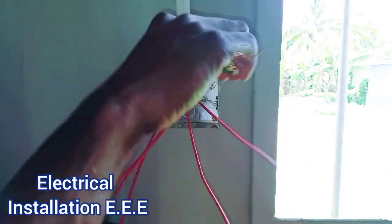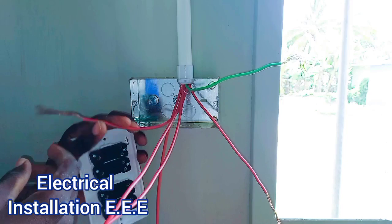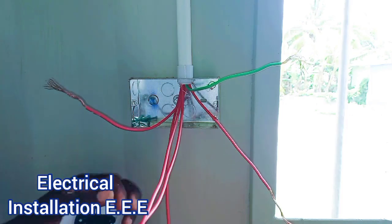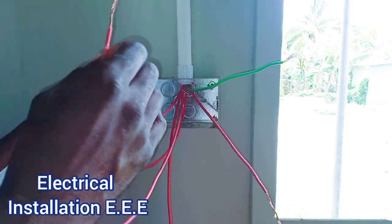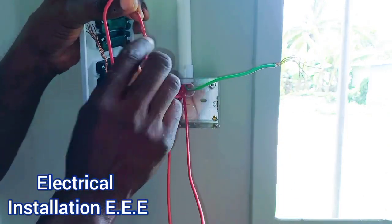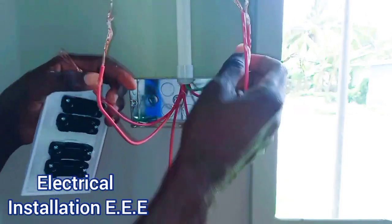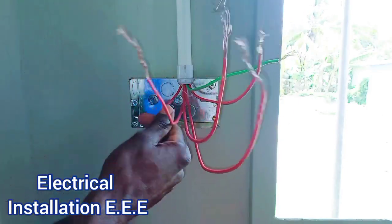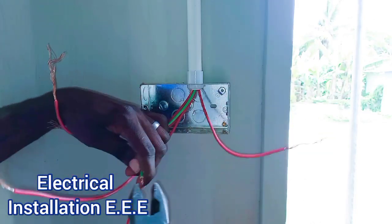Right here you can see we have this with the earth wire. We have four return rails right here. My wires are marked and identified — when you come inside the building, the first one is number one, this is number two, this is number four, and this is number three. So: one, two, three, four. This is the main that's going to feed them — the main doesn't have any mark on it, so it's very easy to identify. First thing first, you're gonna earth the box — always earth your metal box, always.